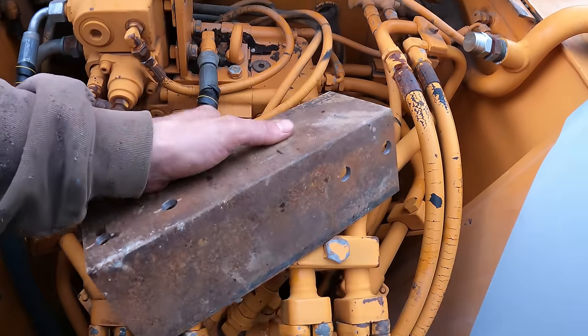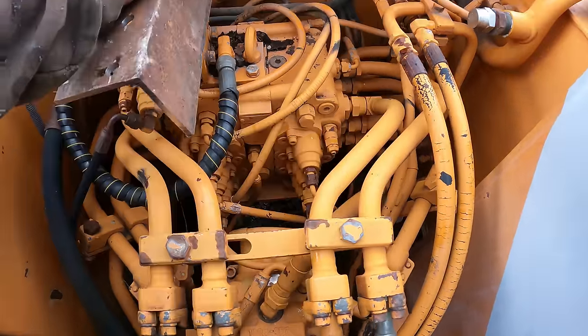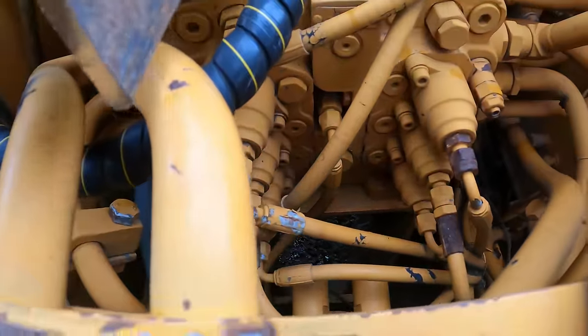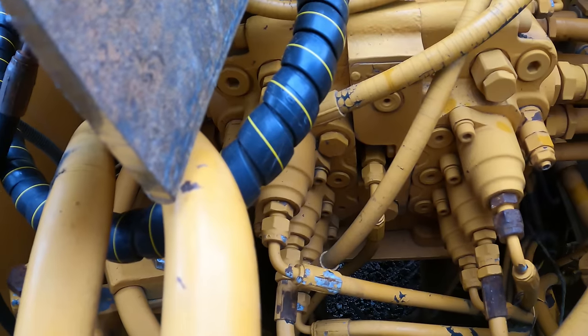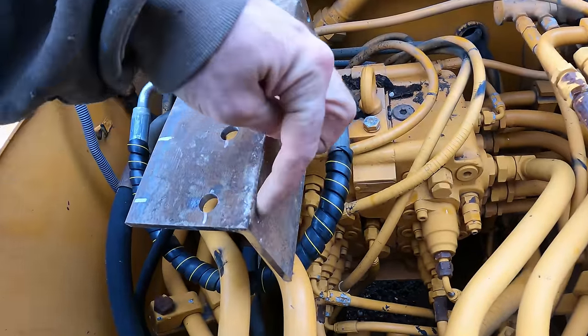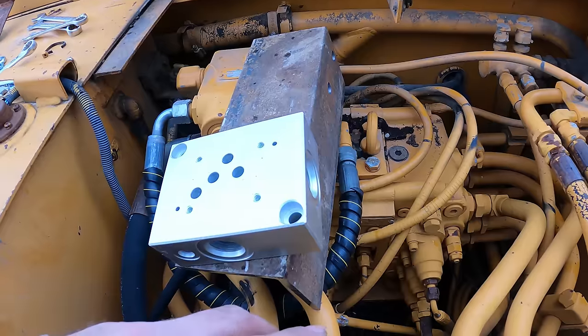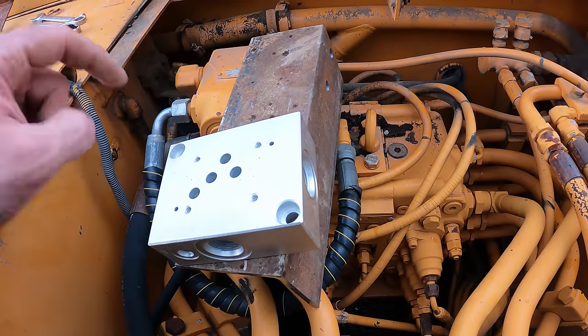I think what I'm gonna do is just put a slice here because it's pretty close to that pipe there. It's almost a quarter inch away, but it's just not necessary to have that right there. Just slice it down there. So I'll have to weld a piece of plate on the top of this angle iron to span that so I can put the holes in it.